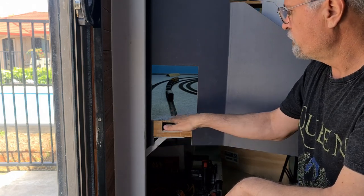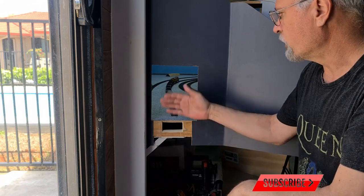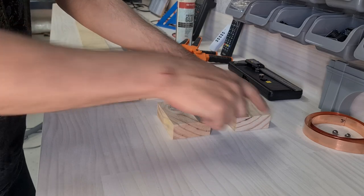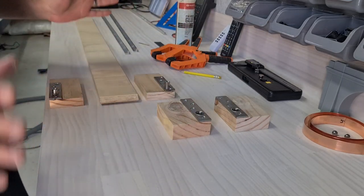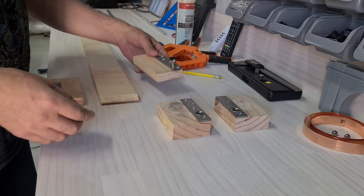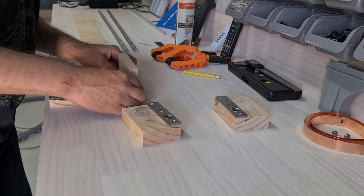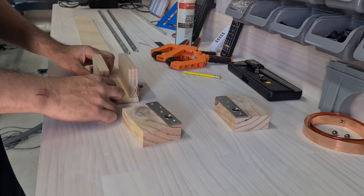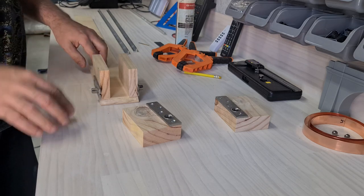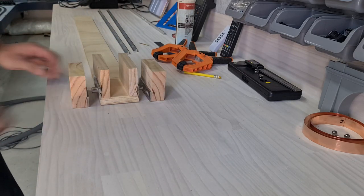I've cut the hole out — that's just enough for the top of the lift-up bridge to get past that lip. The other mechanism also has room so it can lift 90 degrees all the way. In my last video, these brackets were centered to the blocks, but given what I learned yesterday, I've moved them up to the upper edge. That gives me a lot more room and I can now swivel it 90 degrees. So basically these will be attached like so, and then the outside blocks sit like that — that's how it's going to go together.